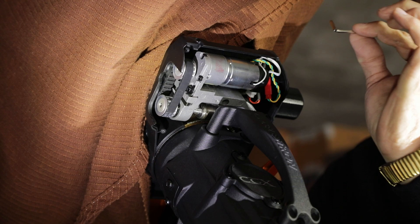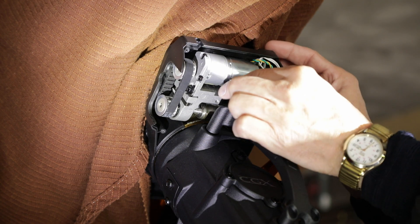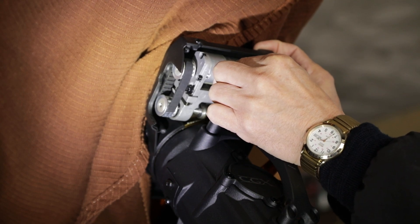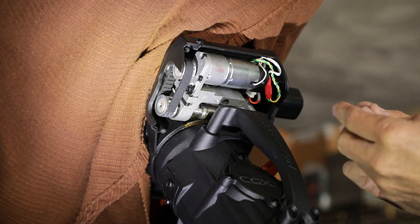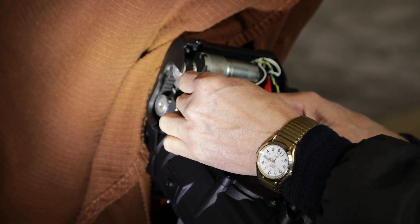So I'm going to leave the big screw alone. Now what we'll see is we have way too much travel in the whole assembly. What we want to do is limit this to maybe a couple of millimeters at most.